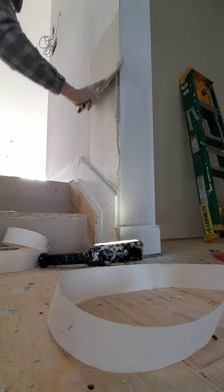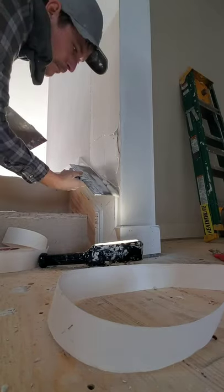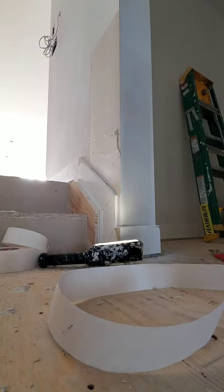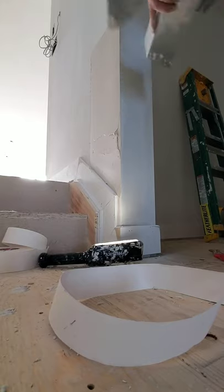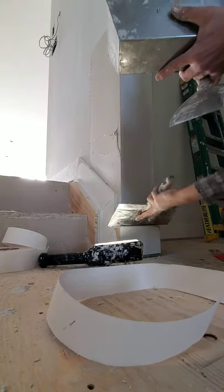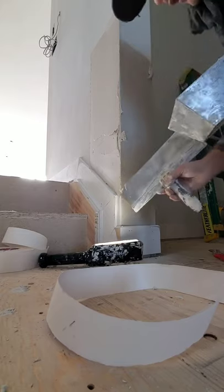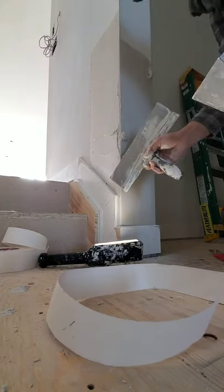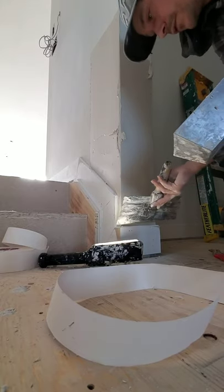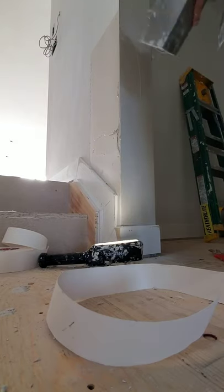Swipes. Before, I said I should have loaded both sides of my corner bead at the same time before I even started lighting. Okay, remove the excess, lightly, very lightly, wipe up the edges at almost a flat position. If you go a little bit too much, you'll rip right into your corner you've been building.